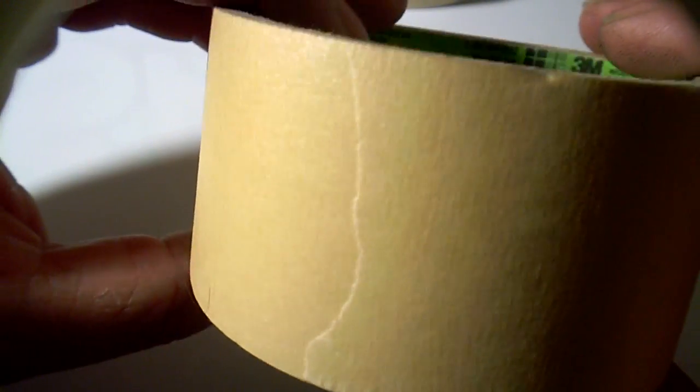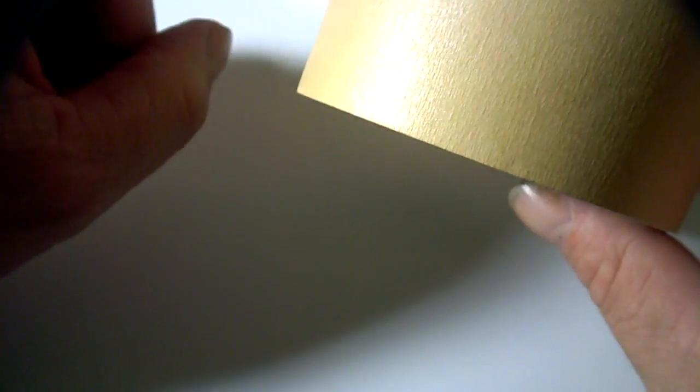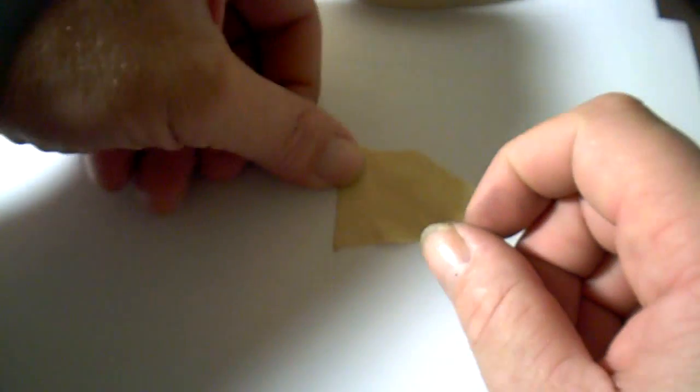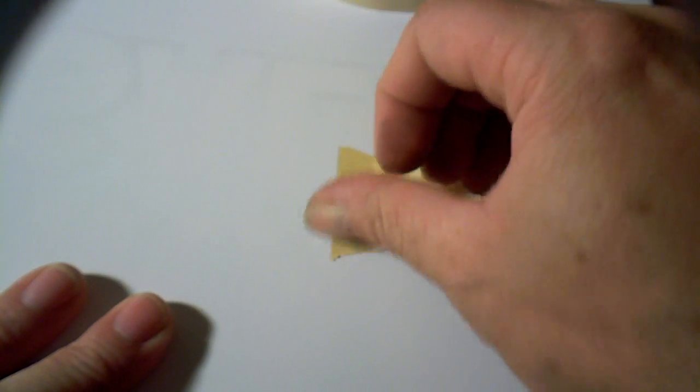That's not ideal for painting on a super glass smooth surface. Now, I ain't saying it can't be done. I've done it. You can go through and just burnish that edge. That's why people say you've got to really burnish the edge down. You know why? Because you're using the wrong tape. Now you're having to take that textured conformal roughness out of it.